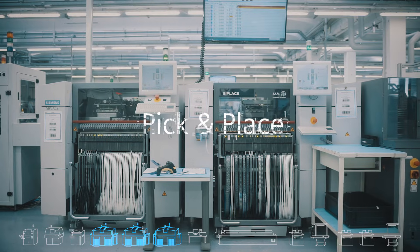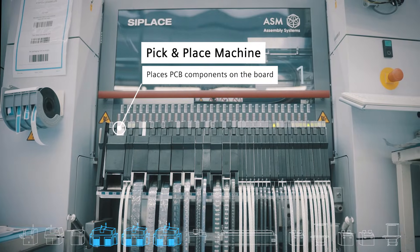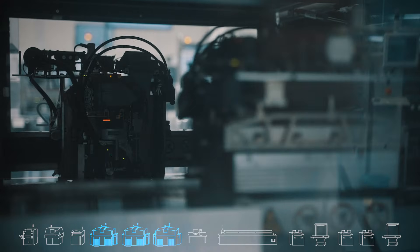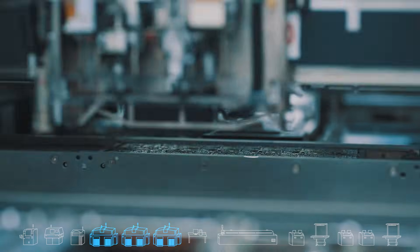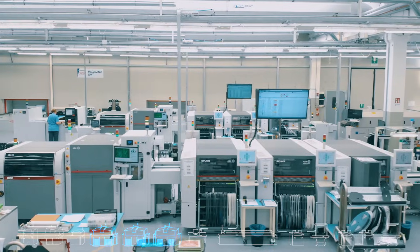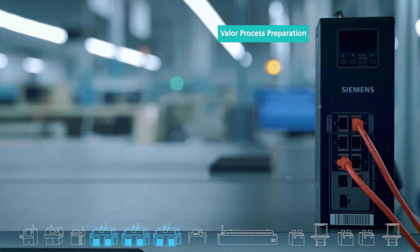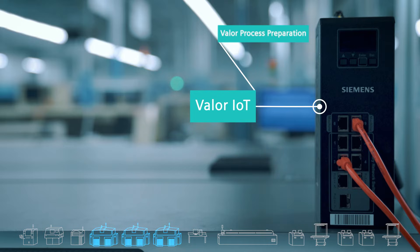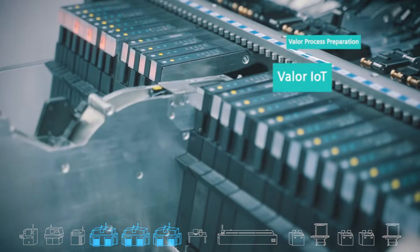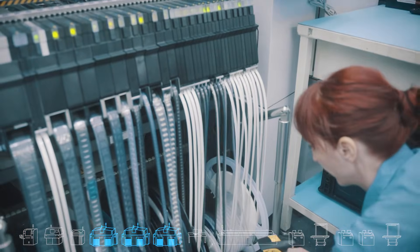Roy has three types of pick and place machines: a fast pick and place machine, a machine with a camera for small and subtle components where accuracy is highly important, and a very strong machine with high pressure for boards that require force in implementing its components. Having different pick and place machines is typical to many manufacturers and allows for high accuracy and flexibility. Valor process preparation can help in generating the assembly programs. Valor IoT manufacturing connects to the pick and place machine and can collect data regarding machine utilization, while Valor material management helps manage the material on the machine and replacement of material when it is consumed.